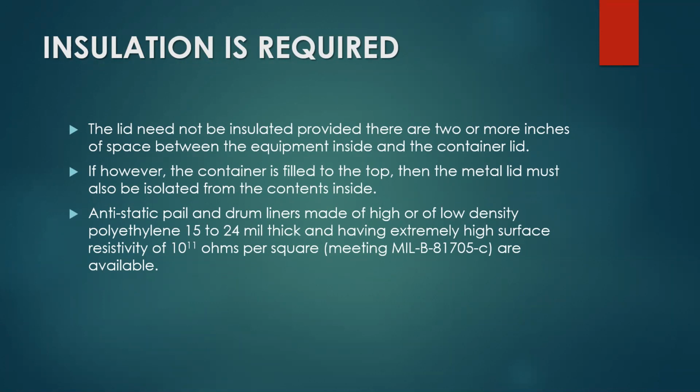The difference is 45,000 volts, and that's what we're trying to protect against. And so having a wooden container, the important thing is it has to be absolutely seamless. If it's a box that you're putting it in, and you have it glued, and there is a millimeter hole between the two edges, that will destroy the effectiveness of that box. Okay, the holes are very important to not have. So that's why you dovetail things, so that makes it very difficult for holes to exist in joints. As a matter of fact, we're going to talk about some of the issues with that.